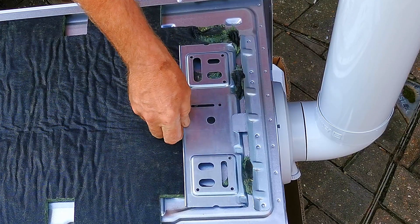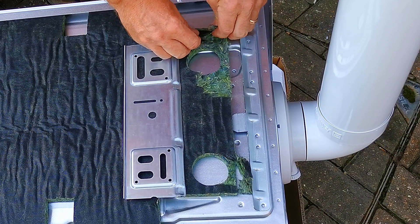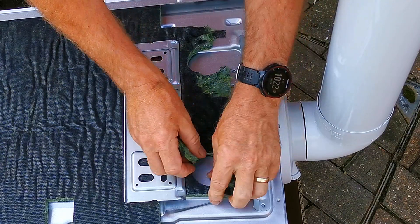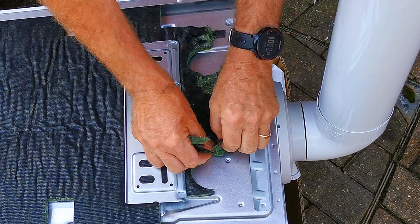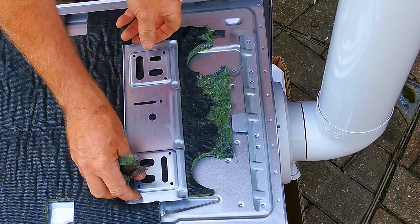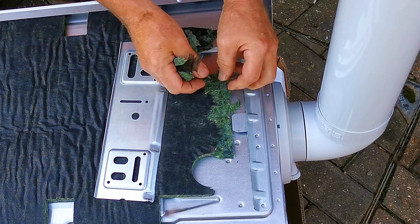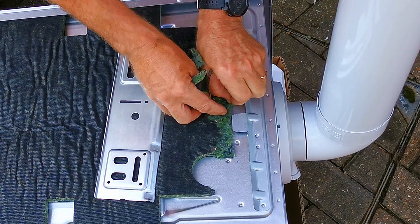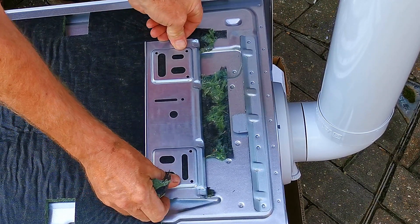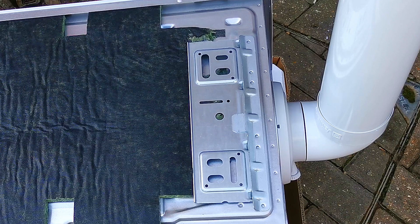It's been made worse because they've put two holes in the insulation and the bracket just seems to grab the insulation and break it off. We all know sometimes we can be in a really tight space - we just lift the boiler up, push it against the wall, then let it slide down waiting for that clunk when it hits the bracket and wiggle it around to make sure it's fully on correctly. The last thing we want is to take the boiler back off. So on this last boiler I decided to just break this bit of insulation off before hanging it, and when I did hang it, it went on with no trouble at all - I heard that clunk as it hit the bracket and it felt nice and secure.